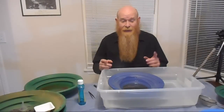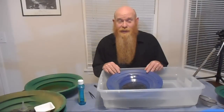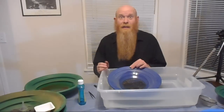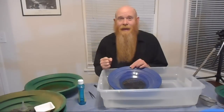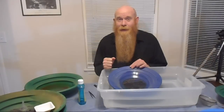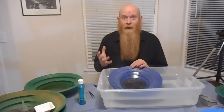One little bonus fact about floating gold: it will actually help in some mining operations. They use this property to actually extract and separate the gold — it's called a flotation cell. They purposely froth water through the gold concentrates with some chemicals to take the gold, or whichever material they're trying to separate, and float it to the top of the water and separate it off the top. They can use that property to concentrate minerals.